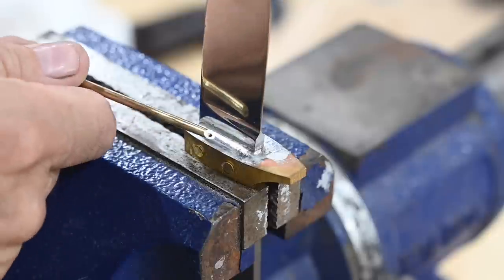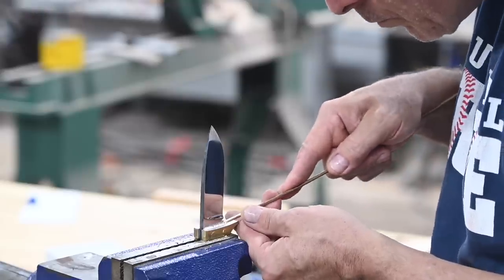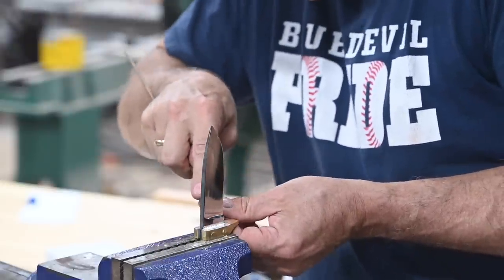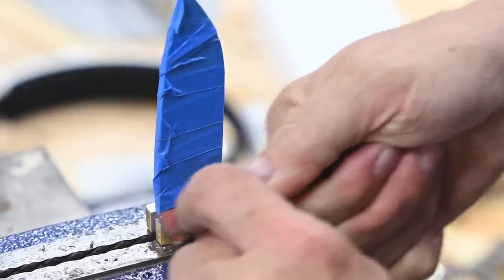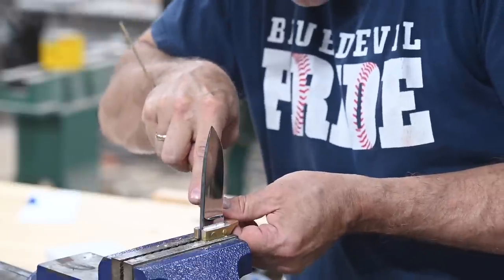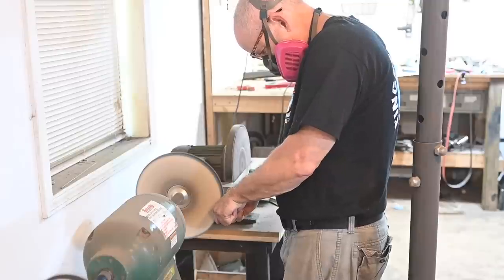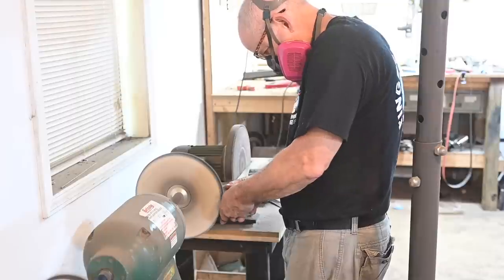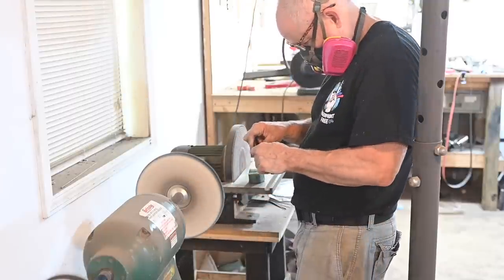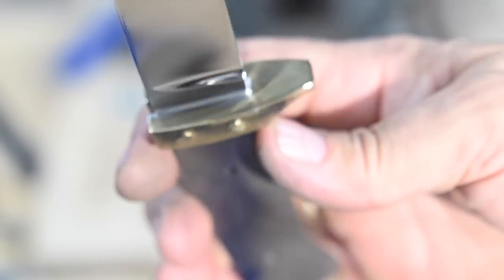If you do this at home, don't get confused and use what is generally referred to in the jewelry trade as silver solder — it's not the same stuff. It goes at much higher temperatures and is just not suitable for this application. This stuff is a lot closer to plumbing solder than jewelry brazing solders. Apply a fair amount of solder to make sure every crack and crevice is filled, then quickly cool it in water before the blade overheats. Then, using a little brass rod with a bevel ground onto it, you scrape back the solder to produce a nice, clean fillet. I was afraid it was going to look bad, but the whole thing just completely disappeared under the buffer, leaving a really nice, clean solder joint.